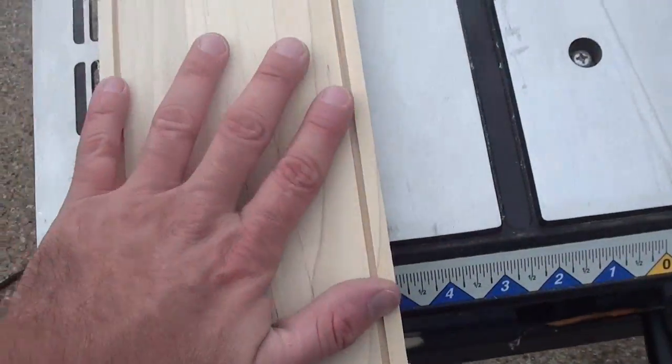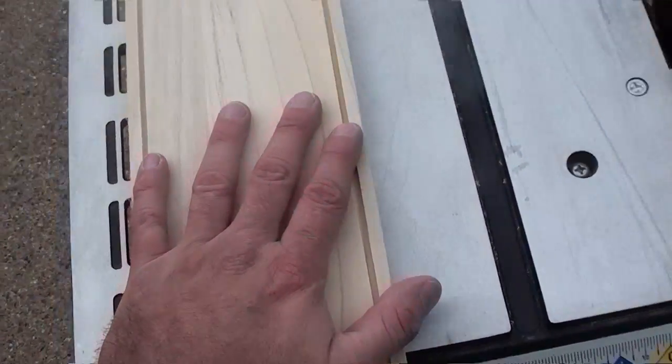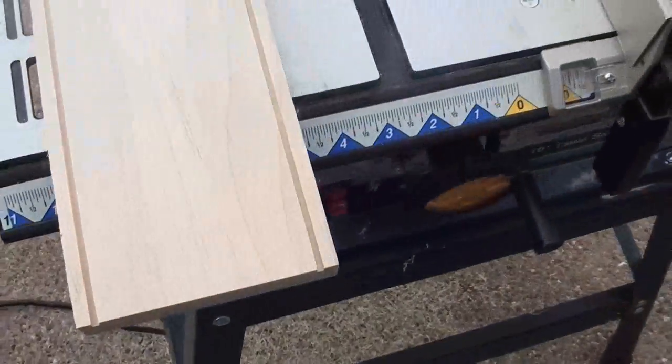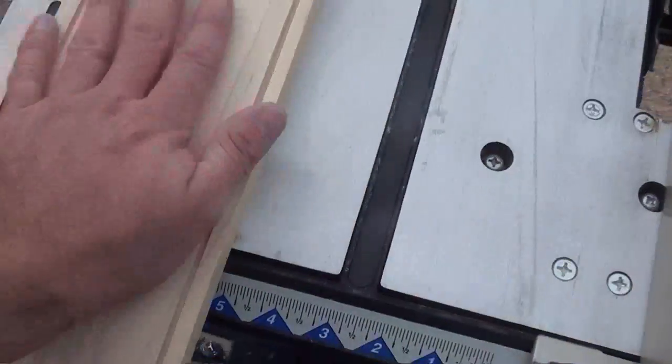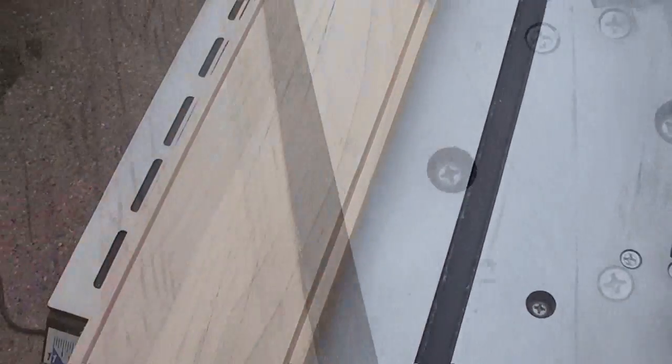Oh, I have the 2 side grooves done. Now I got to widen them to 1/4 inch. So I'm going to move the fence guard over 1/8 inch, use my test piece again to see if it's right, and then do my other cuts on this. This ought to be fun. Be back in a bit.